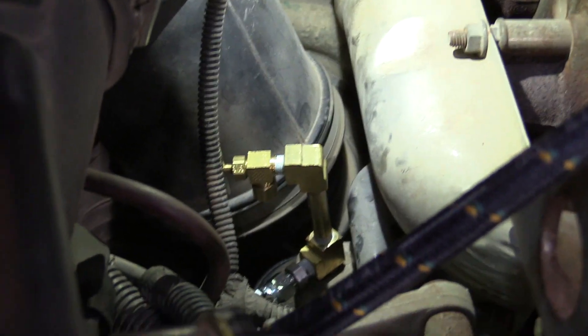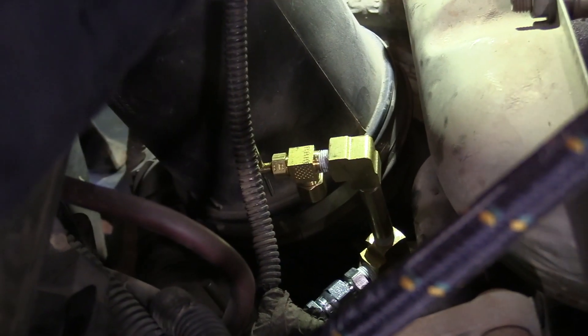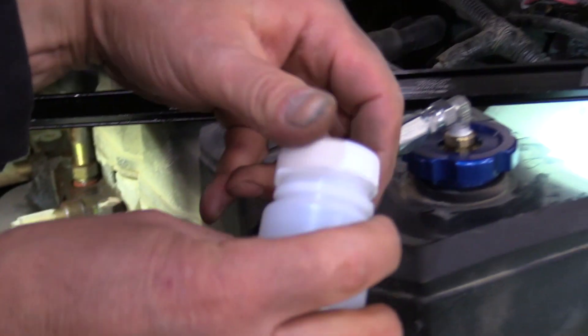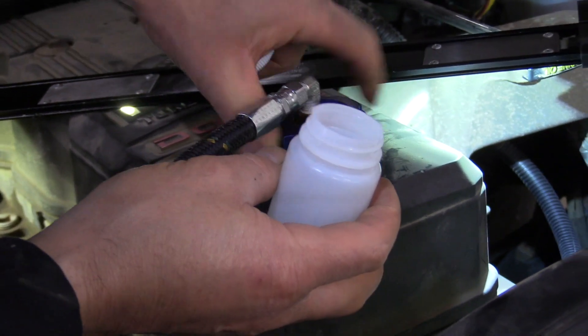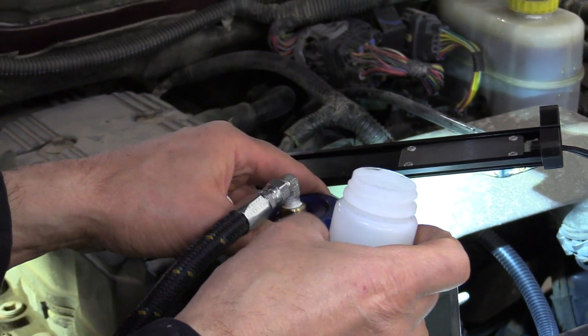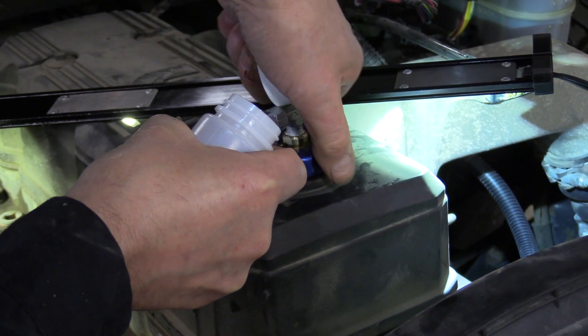Going to take a sample here — you can bring the bottle in right under here, cap off, go ahead and take your sample, and when you're done put your cap on and you're done. That's how it works with the valve setup down at the filter head. If you want to take the sample over here with the engine running, the fan is right there and it can get messy — it can blow that oil all over the place. So you have to choose: I can supply the parts for the one down on the filter head, or you can use the fill port to take your sample.